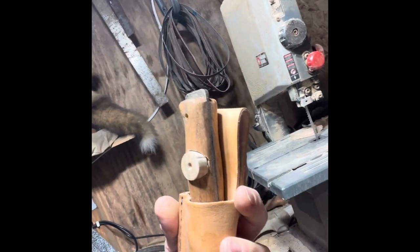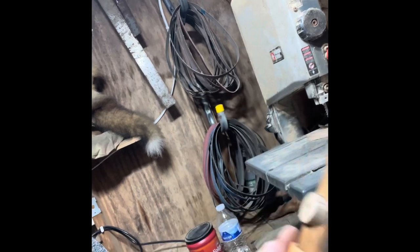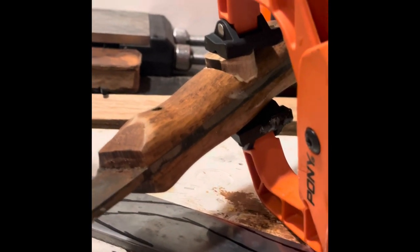Here's what we've done: I made a plug out of a piece of ash, oriented the grain with the hole. We'll take it inside, glue it up, then reprofile and refinish the handle. When something bad happens, find a way to fix it — that's all you can do. Just find a way to fix it, so stay tuned and I'll show you the finished product.